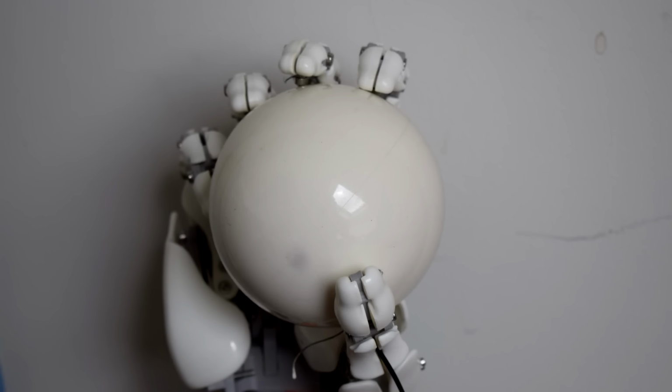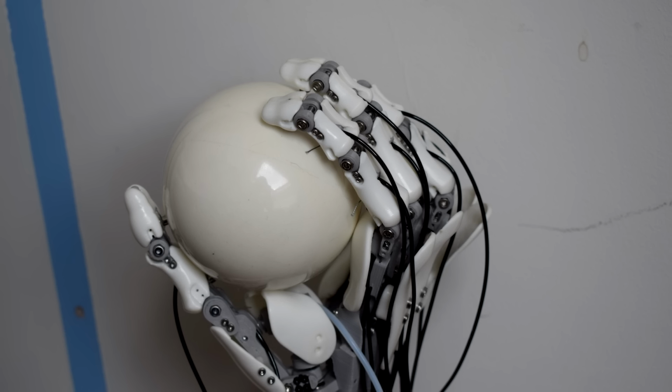So I thought for a really long time about how I could make a mechanism to, without really overcomplicating it and adding too many actuators, automatically have the finger twist inwards as it did the lateral side-to-side motion in the MCP joint. So I drafted a few ideas, and I decided that it'd be best just to simplify it to two axes, like a double hinge joint.